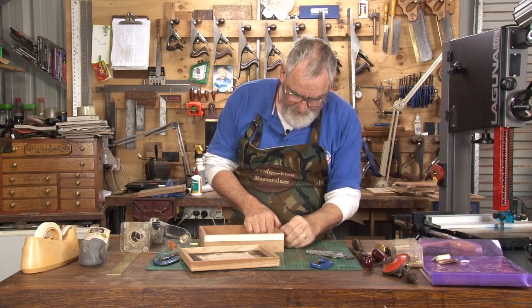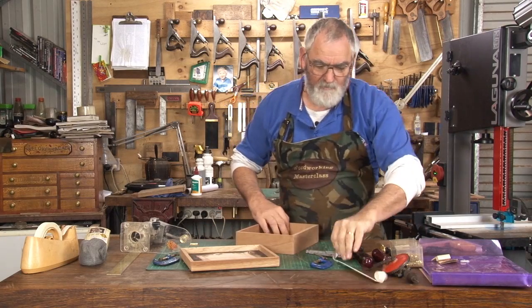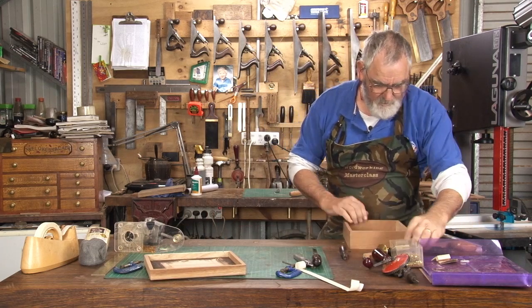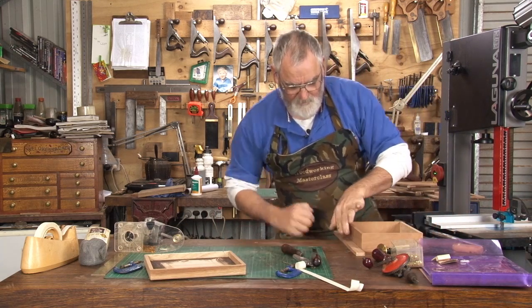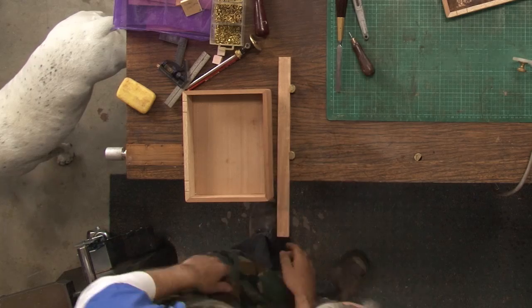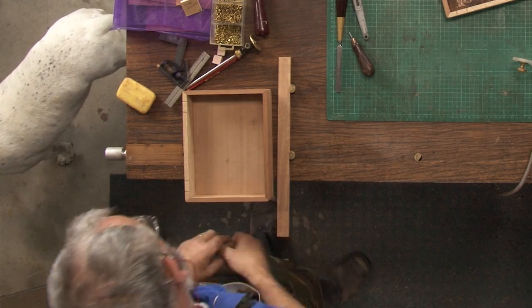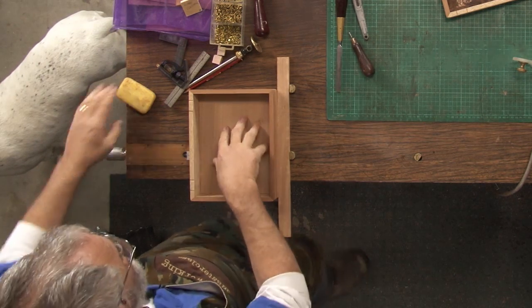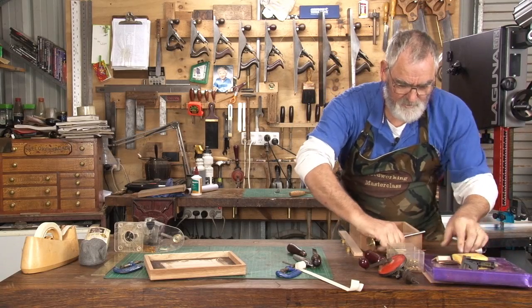Take this tape off for the moment. When I router it too, I do it very gently and not in one fell swoop. And it doesn't matter if you don't get everything out, because you can clean it up with a chisel. There's my little block. Got this here. It's a great little tail dogs here.